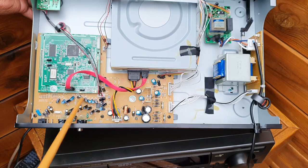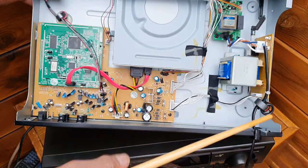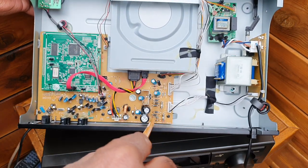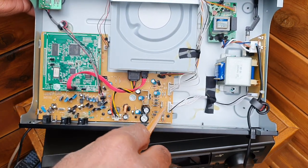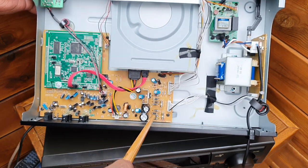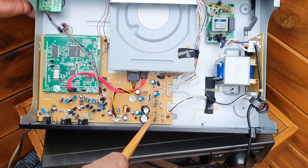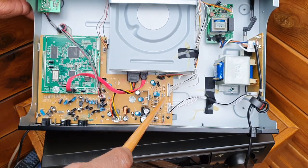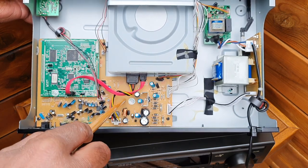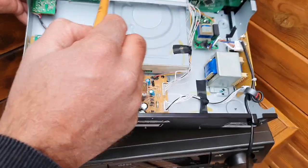You see you have two small amplifiers for the analog out, if you are able to see over there, these two. And this is the bridge rectifier. These are two fuses, and they have two bridge rectifiers, so it appears they are doing two separate power supplies, maybe for this device separately and for this circuit separately, I guess. One is going over there for the front panel.